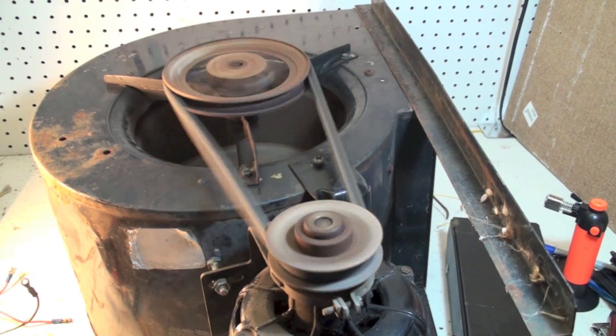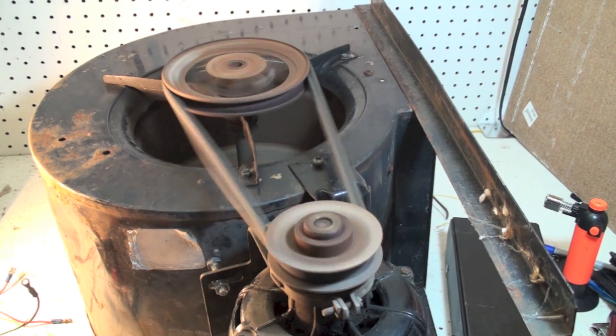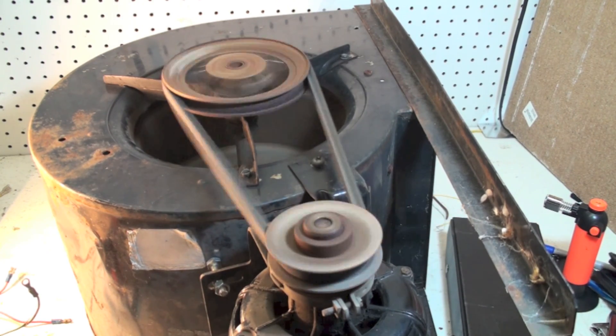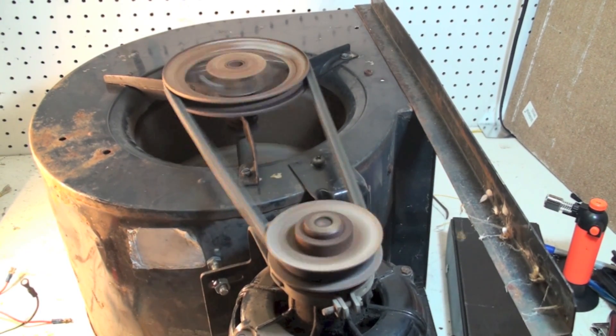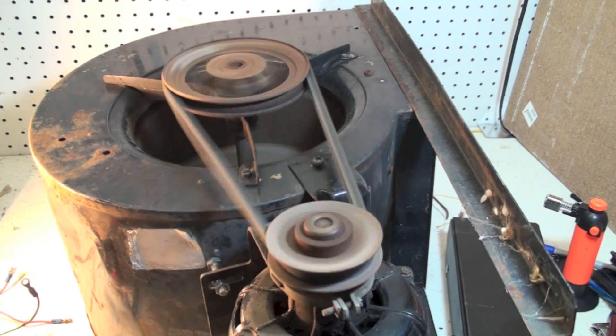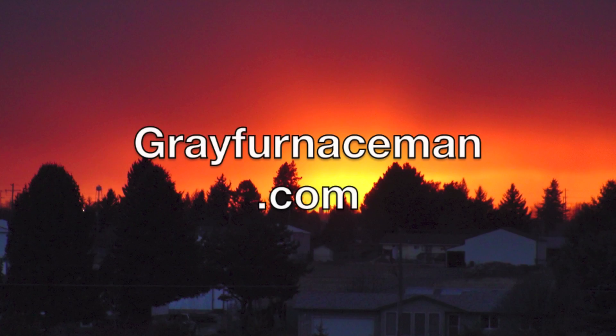If it's over one horsepower, remember those belts have to be tight. Most of those motors are not resilient mounted, and you get them tight with about a one-inch depression that you can push with your thumb — that's usually good enough. There are tensioning gauges you can use, but I've always used that. To summarize: under one horsepower, keep the belt pretty loose; over one horsepower, very tight. If the belt squeals on startup or while running, check the condition of your pulleys and belt — if those are good, you'll need to tighten it a little. Alignment is important too. And that's it for adjusting belt drives.